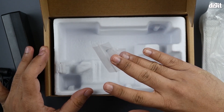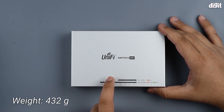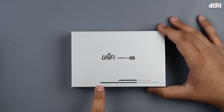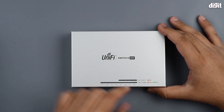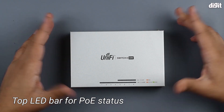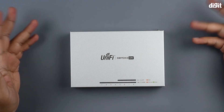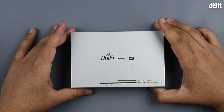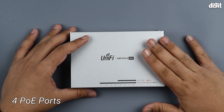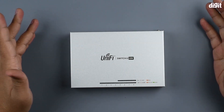Now let's take a look at the device in detail. On the top surface you have a couple of bars. The bottom bar has your LED indicators running from one to eight — those are all the port numbers. The second bar on top tells you the PoE status, that is the Power over Ethernet — how much is being occupied and how much is actually drawing power. Even if you don't require PoE on any of the ports, you can still connect devices to this switch.